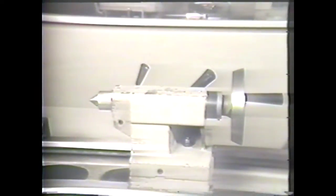This is a dead center mounted in the tail stock. A center is considered dead when it does not rotate with the work, but provides support for it. This special dead center, called a half center, allows work held between centers to be finished to length.